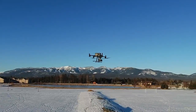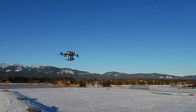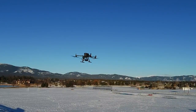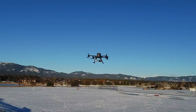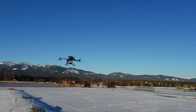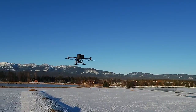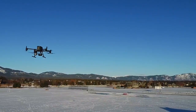We could obviously sync up both cameras — you can even run three cameras if you add a top mount and sync them all up, though I don't really see a huge reason for three payloads, especially now that the H20T is out. You pair that thing with a spotlight and off you go. The 300 has just got a low hum — pretty quiet up there. The 300 is probably a little bit quieter than the Inspire 2 — nice, torquey machine for sure. Another cool feature: you can frame up your zoom camera from the wide camera. If you're at full zoom and trying to make small adjustments, it's really hard. The ability to use the wide camera with a box on the screen showing where the zoom camera will be, frame up your shot, switch over to zoom — and that's it.